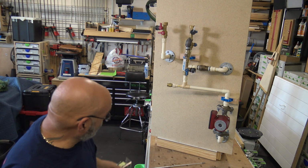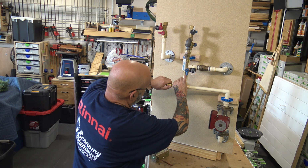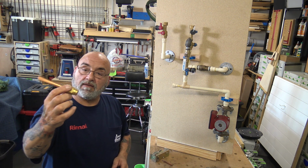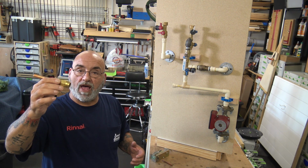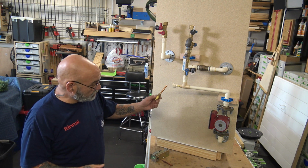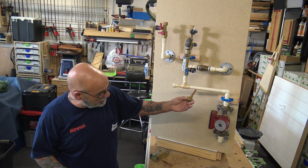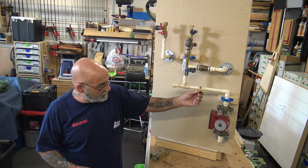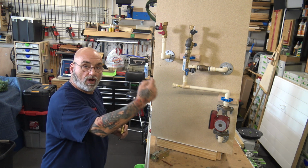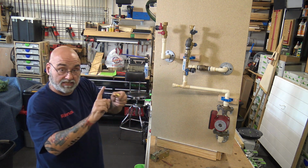Now, I'll show you the well. It's a 1/2" male IPS thread. That's the well. It's just a Honeywell aquastat well 1/2". They make them 3/4, but it's a 1/2" well. And it goes into a female adapter, and you see how far it goes in? Picture this as a T this way. Look how far out you'll be, because you don't want this banging into the back of the pipe, and it doesn't register, because the water is going to go in a little bit, but here it's going, well, I can't go that way, got to go that way. So it's sensing this.